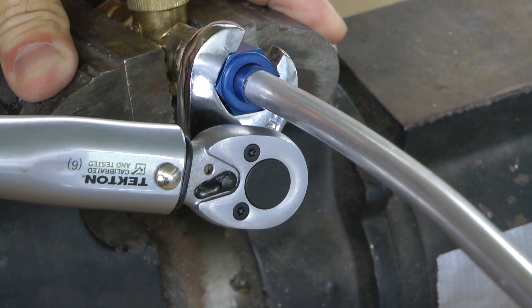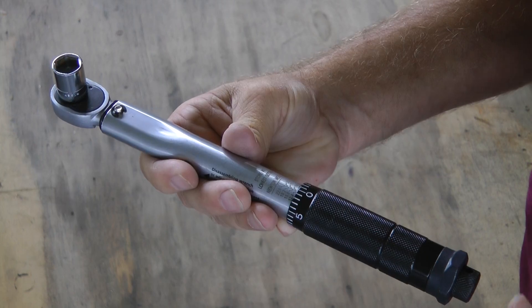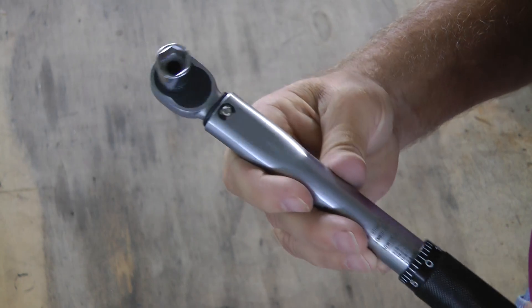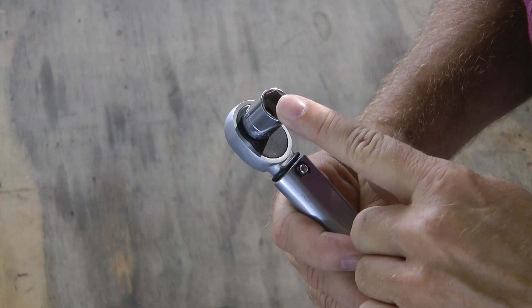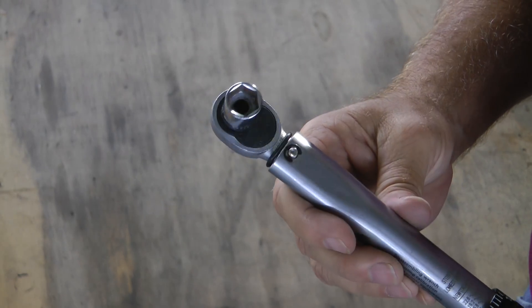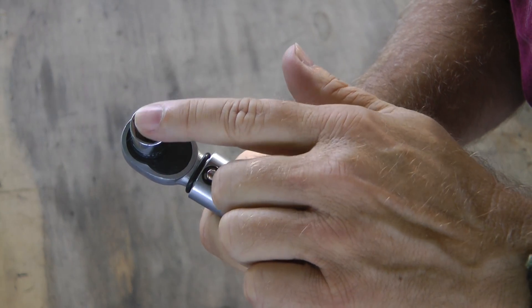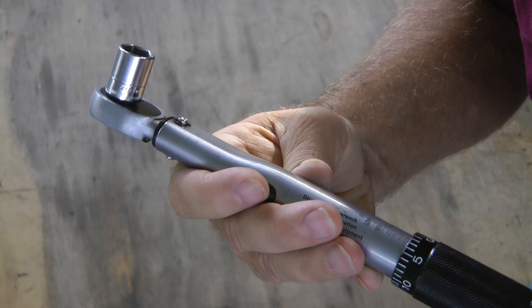Let's look at using a torque wrench on these fittings to apply the proper tightening values. Here is the torque wrench we'll be using — set and calibrated in inch-pounds. Normally we use a socket to tighten a nut or bolt with a torque wrench, but that won't work over a flare nut, so we're going to replace the socket with a crow's foot. One of the most important things when using a torque wrench is not to change the distance between the handle and the location of rotation, as that distance must remain the same to get an accurate torque reading.